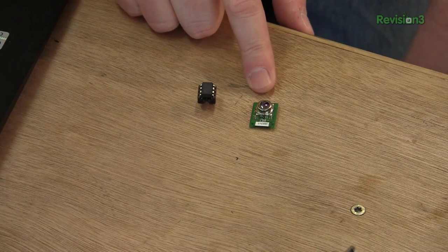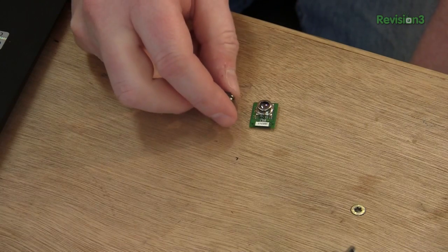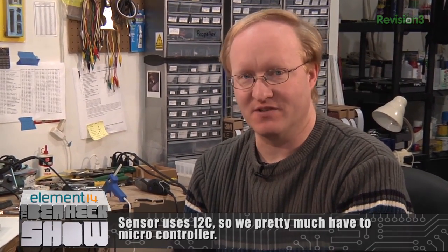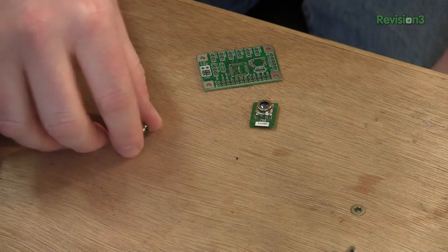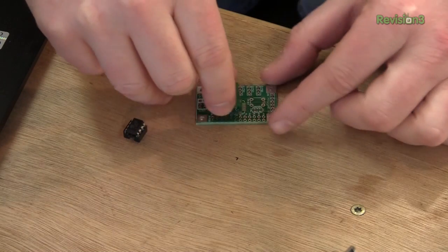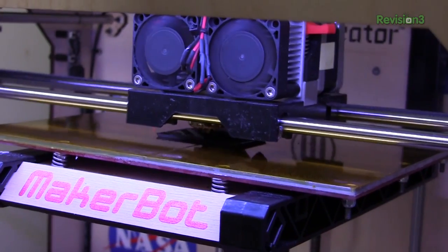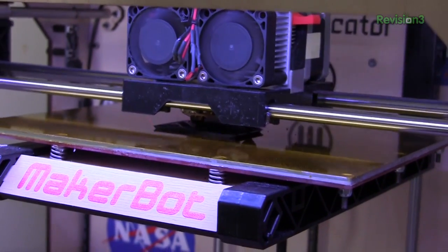The infrared sensor is quite small, so I thought it'd be cool to use an ATtiny to drive it. However, there isn't enough RAM in the ATtiny — at least this particular one — for the I2C library, so I'm going to have to use my other AVR development board instead. It won't be as small, but I think it will be small enough. This will be a little device that you nestle in with your electronic components on your television, so I'll make a 3D printed case to put it all in.